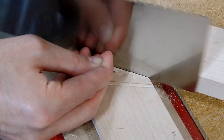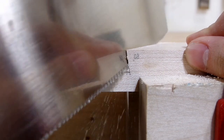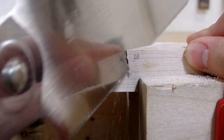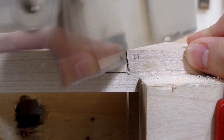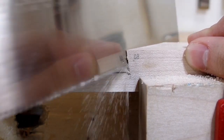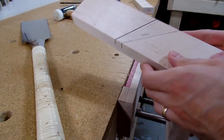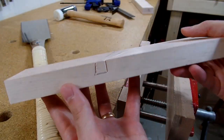This is actually the first time I've tried this, and it worked remarkably well. I highly suggest this as an easier way to achieve a straight cut. For the wedge cut, I started with a square piece clamped to the board to ensure the starting cut was straight, but then I had to freehand the angle of the cut as best I could. And here you can get a good look at the bed angle and wedge wall cuts.